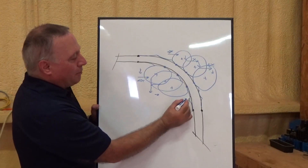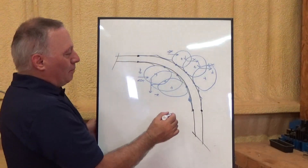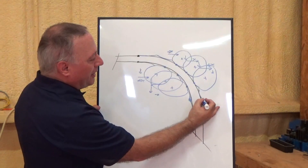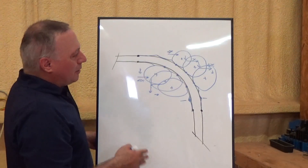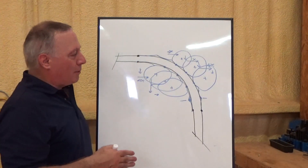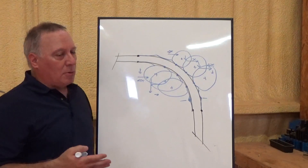And so you're going to be leaving these little pieces of pie. Your surface is actually going to be bigger than it's supposed to be — like, the wall thickness, if you were to measure it, would appear to be thicker than it should be. But you can make these deltas as small as you want, whatever your patience and time constraints will allow. And you can actually make it look as smooth as you like.